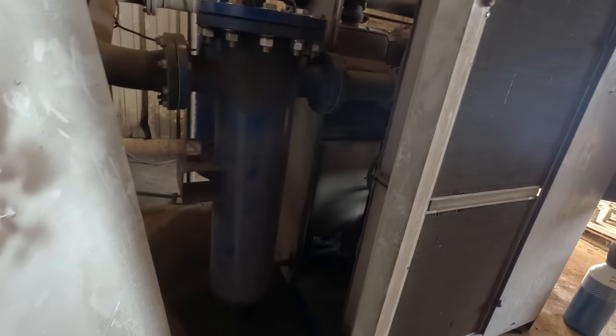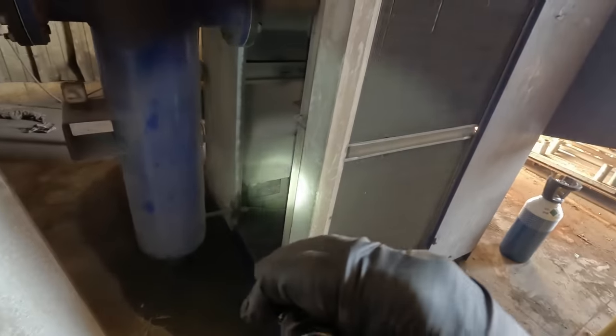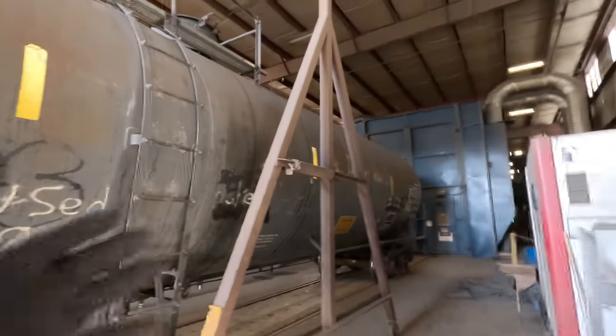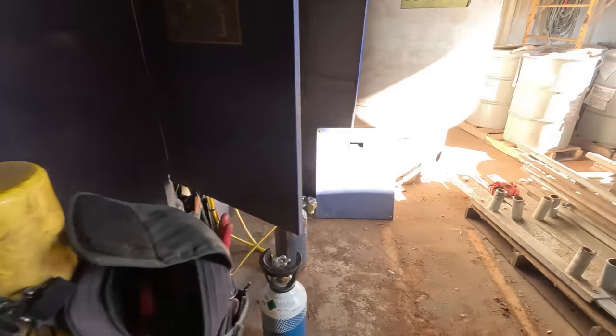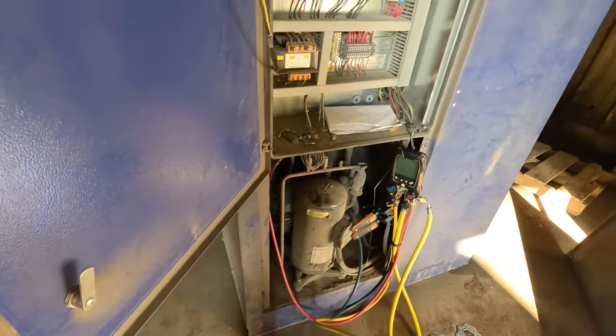It's kind of pretty important from what he's saying. The other cover on the side is taken off so you can see moisture or whatever. I tightened up those fittings on that line. What happens is it condensates in the bottom and blows it out to the outside wall. It's a horrible location for this because they're literally sandblasting rail cars out here and all that dust gets into these. That's a high-dollar air compressor right there getting all that dust and blow-off right into its fins — just not a good idea.